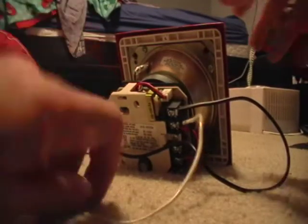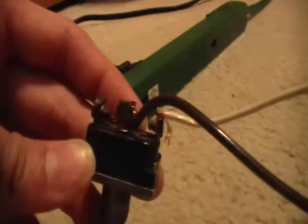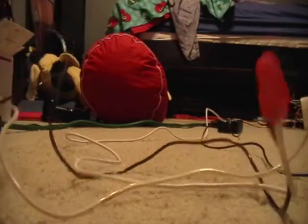Okay, then you have your switch wired. Let me go over it to make 100% sure I did this right. My positive from the power supply goes into the middle switch terminal on the position switch, then goes to the other part of the switch and out to the positive on your alarm. And then the negative from the power supply goes straight to the negative on the alarm — it doesn't have to pass through a switch. So after you connect all that and plug it in and give it power, whenever you flip the switch it'll work.